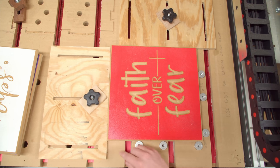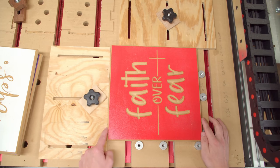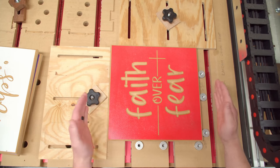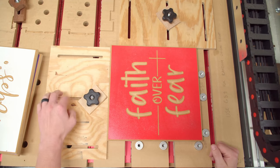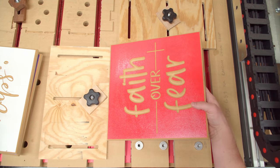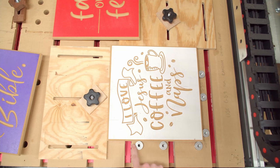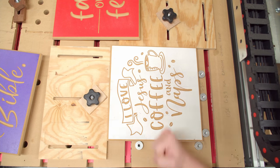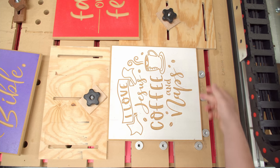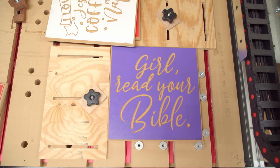The fact that I put the round over on before carving really helps with sliding pieces on and off. If I had not put the round over on, I'd have to loosen the two stop blocks every single time to get the piece to fit down perfectly. What the round over does is make the bottom edge kind of like a wedge — so you're just wedging it in there. I put the stop blocks in really tight, and when a piece is done carving, it's just a little bit of pressure to pop it out, bring the next one in place. The rounded bottom edges act like a wedge, and the dogs don't mar up the edges.